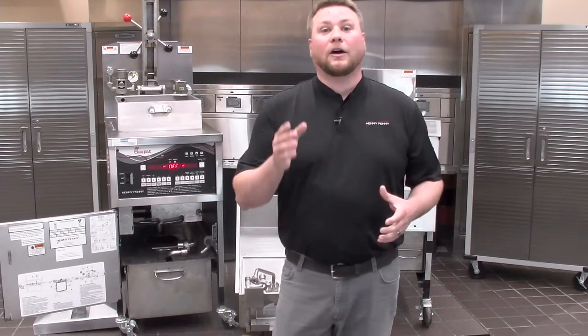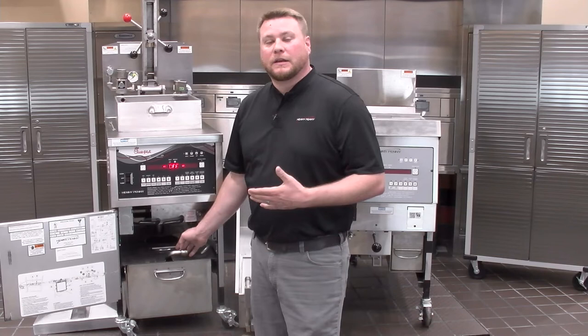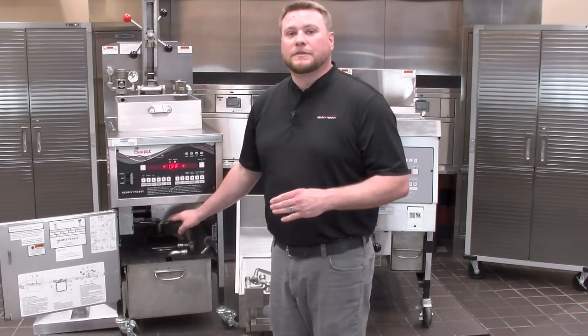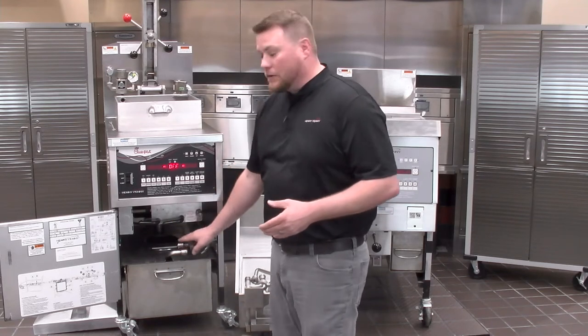This is a great way that we can help alleviate some of those service calls in situations where the filter pump motor might not be coming on, or maybe it's coming on but we need to know if we have suction at our dairy union connection. The key thing to remember with our pressure fryers is we need to make sure that our filter valve is in the open position when we're running that filter pump motor — otherwise it won't give us any suction, and we could think something's wrong when it's actually not. Also with the pressure fryers, the dairy union connection could be loose and sucking air, so make sure that's tight. We also talked about the orange dispose hose and what we can do right at the store level to help eliminate those costly service calls.